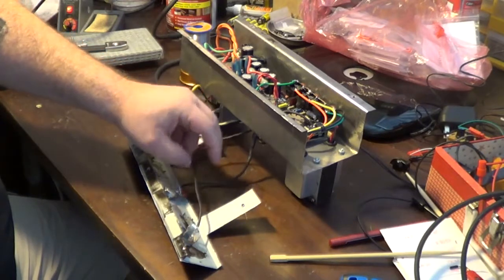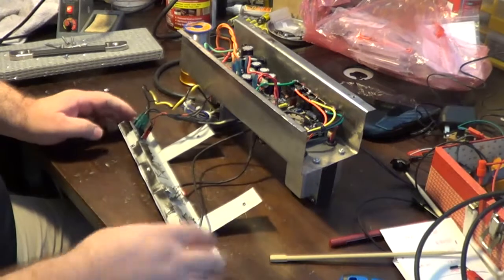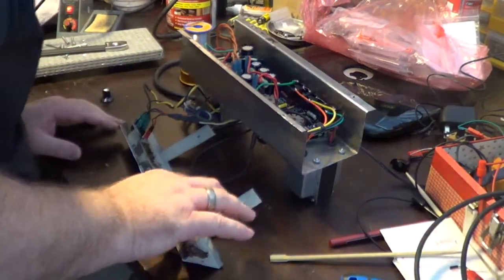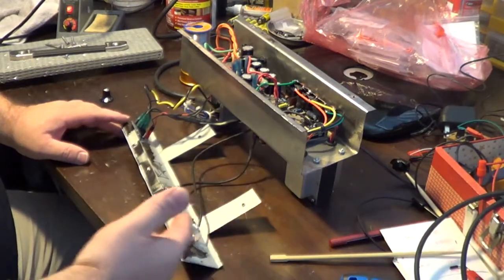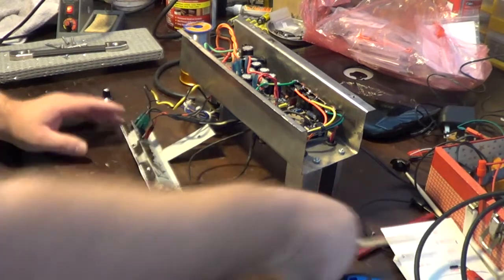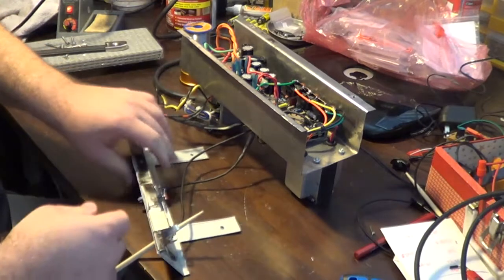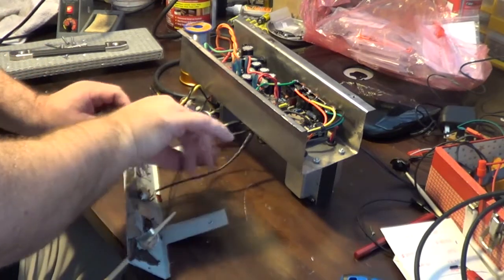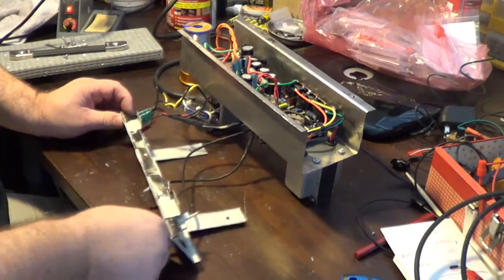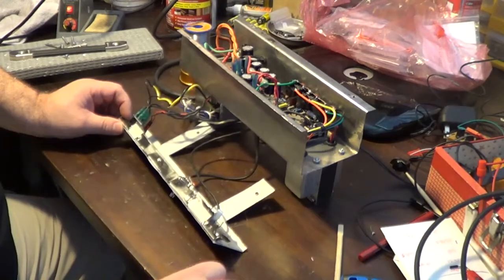And the microphonics are now no longer present. I can hear the hiss in that thing, but even if I touch this guy, the microphonics are gone because the signal is being shunted to ground. Let's see if I put this back in here. There. I separated it and it took the hiss away, but now the microphonics are back. So having this thing shunt that to ground takes the microphonics away.